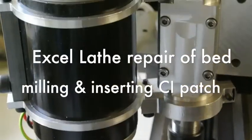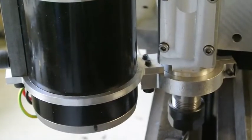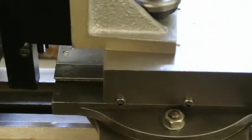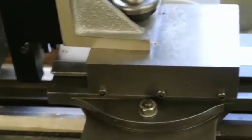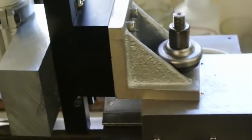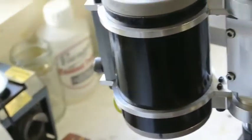This is my milling spindle mounted vertically rather than the usual horizontal position on top of the lathe. I've just moved it around here so you can see how I've mounted it. It's a bit Heath Robinson but it's rigid enough to work. It sits on top of the top slide so I can use the top slide to move it up and down the bed and the cross slide to move across it.